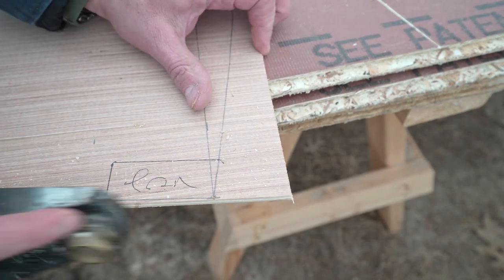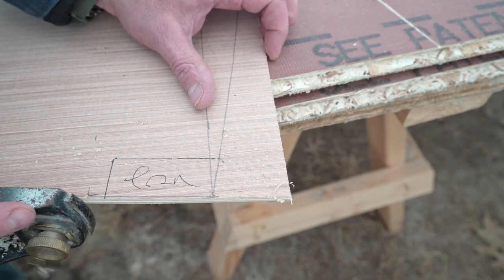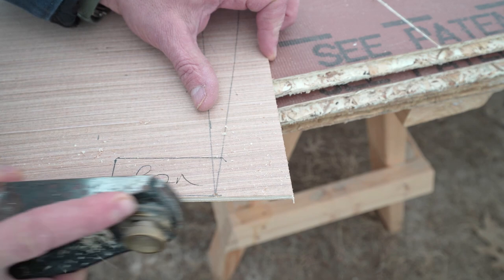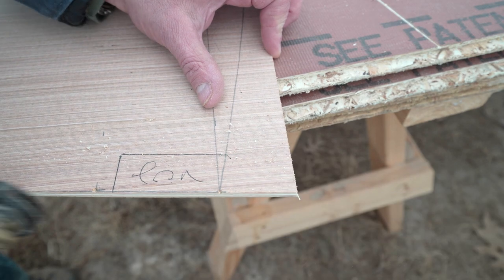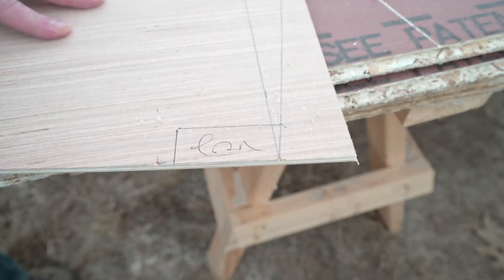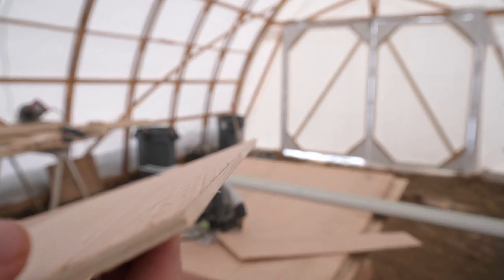A little easier on these convex surfaces. Back here at station 9, the top sides have some tumble home to them, so it makes it nice planing the outside of a beach ball as opposed to the inside. I think that looks good from here and good from here.